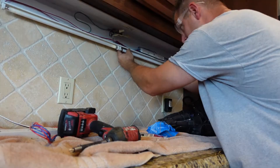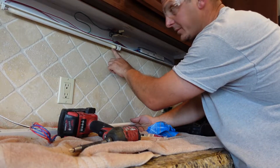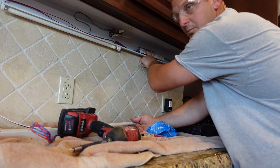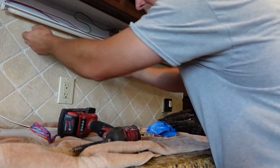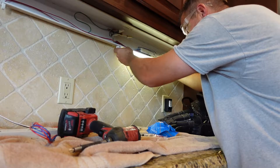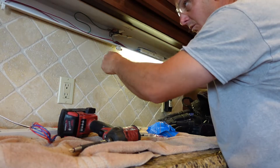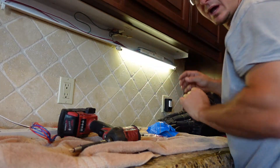The next thing I'm going to do is take this light out and switch it to the other side to see if it works over there. See how this one lit up a little bit — that tells me more than likely this ballast is bad, because it switched its power a little bit. I put this lamp in here and it works, which confirms this ballast is bad.